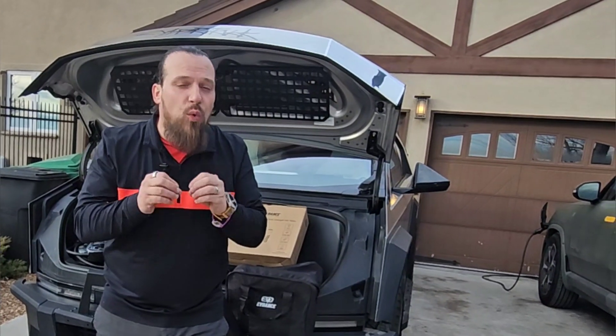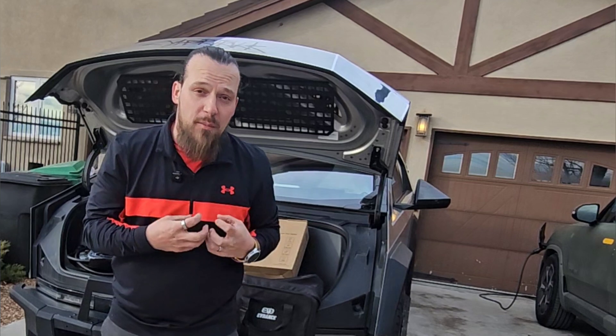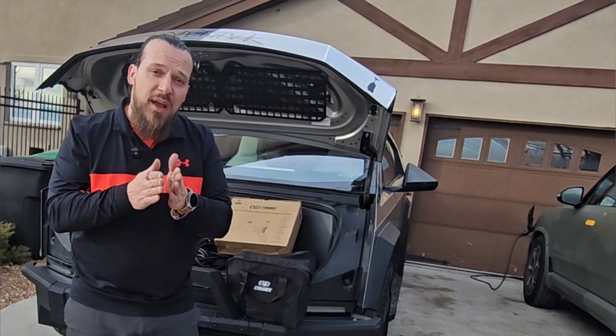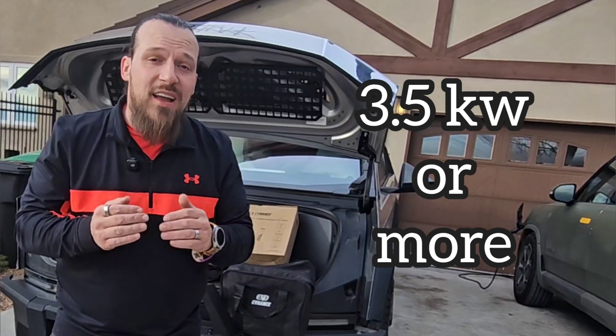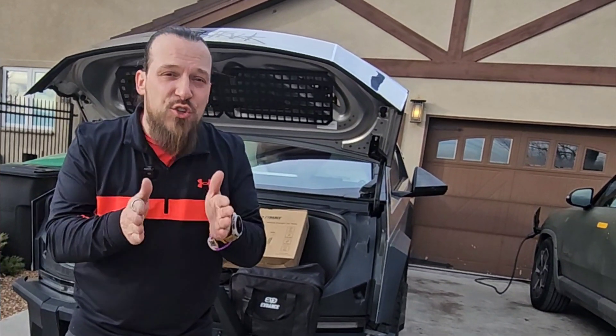Next is kilowatts. A watt is very similar to amperage, but everything in electrical — especially here in America, like on your power bill — is done in watts or kilowatts. Make sure what you're buying can handle up to 3.5 kilowatts or greater. If that number is below 3.5 or even in the 2.5 to 2.8 range, that's going to be too slow.